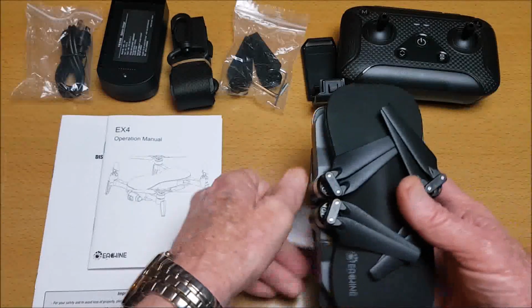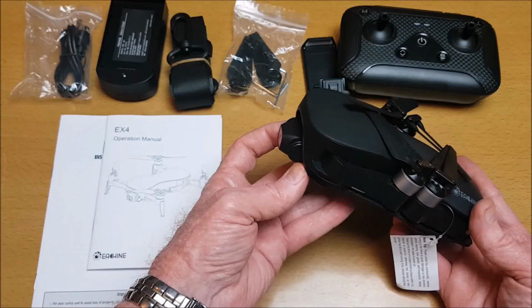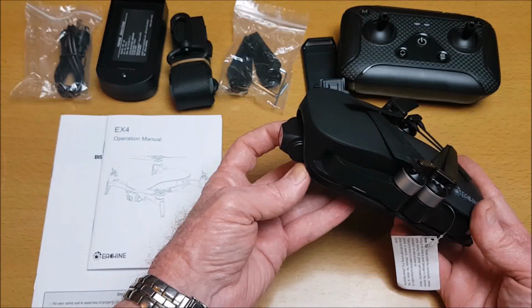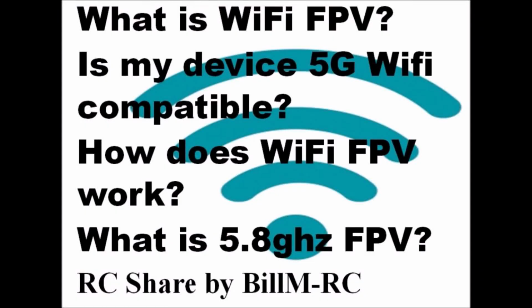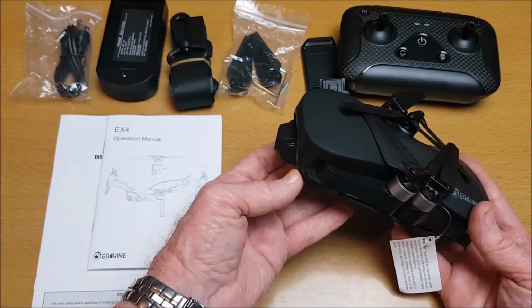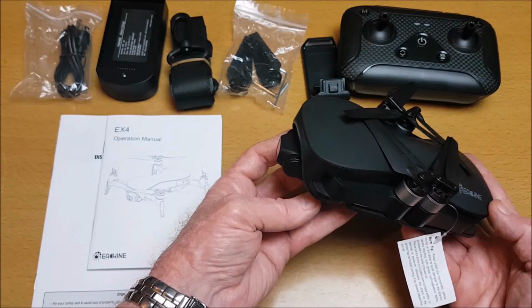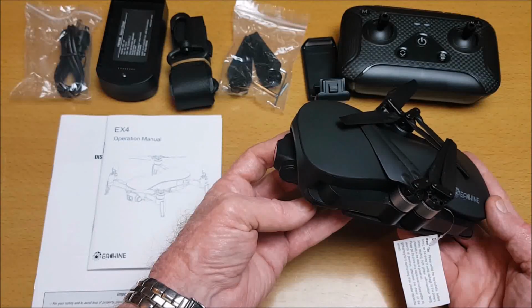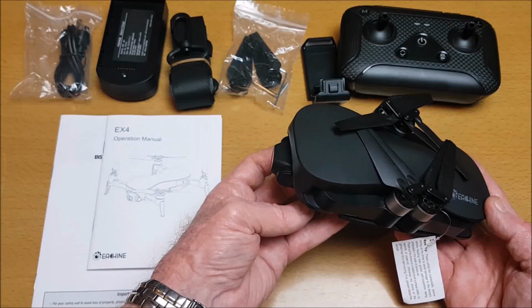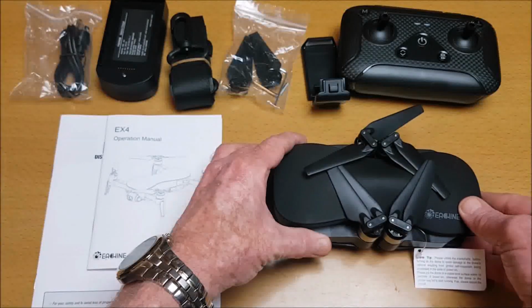And because this has 5G Wi-Fi compatibility only, you need to make sure that your wireless device that you want to use with this is compatible for 5G Wi-Fi, and I'll put a link to this video in the description, which will give you a guideline on how to check to make sure your Wi-Fi device is 5G Wi-Fi compatible, and also explain the difference between 5G Wi-Fi for this and a 5G cellular network and 5.8 gigahertz FPV. It'll also show you how to connect to Wi-Fi.